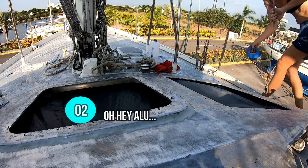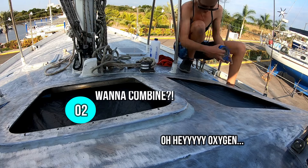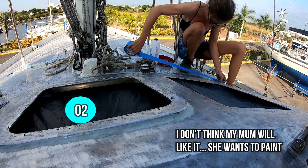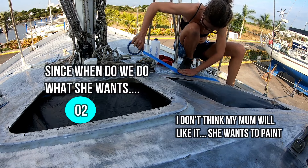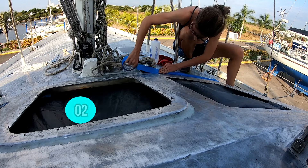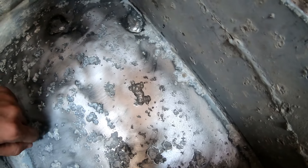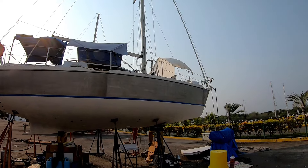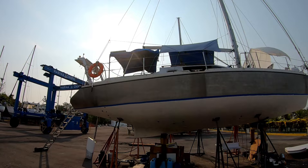Aluminium oxide forms when the molecules on the surface of the metal degrade and combine with oxygen. This surface oxide helps protect the lower layers of metal from degradation, and thankfully this type of corrosion normally takes decades to cause any weakness. However, you do see built-up areas of aluminium oxide in severe cases, just like in my poor aluminium water tanks. This protective layer is why we leave Chuffed's sides bare — above the waterline the oxide layer is enough to protect her.